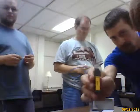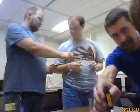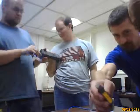You can actually get a kit with a Fluke tester that lets you, when you're punching down drops and panels, plug these IDs in at different drops throughout the building. If you're doing a whole room, you could get up to several different numbers of IDs. You plug them in a certain sequence all the way around the room, and then you can run a test on each of the drops. You can validate that the drop is working properly. That's for testing from the panel to the drop, and it also lets me tag the panel with whatever drop number it is.